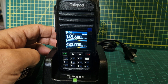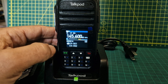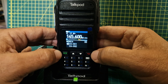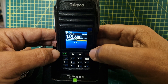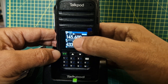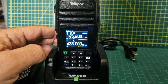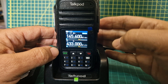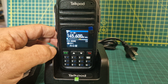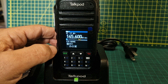Once you've set it up you can put that into a memory. Menu number 8 is memory, then you choose a channel - go up or down and put it into number one, confirm. Back out and we're in VFO mode. Hold down the green button to put it into memory/channel mode - channel one, we've got GB3WR in there. For naming, we go to menu and find menu item 001 which is called Name.